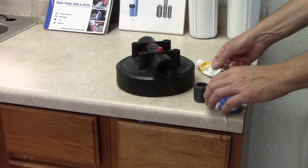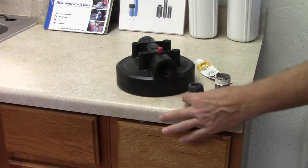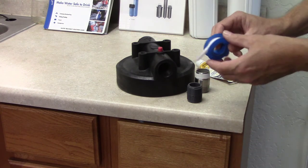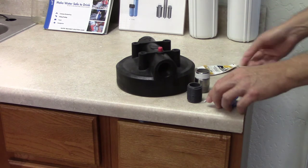The two things we're always going to use when installing a male threaded piece of any material — Schedule 40, Schedule 80 — that's Schedule 80, this is stainless steel. We're always going to want to put some wraps of Teflon tape and a little bit of Teflon paste on the fittings.